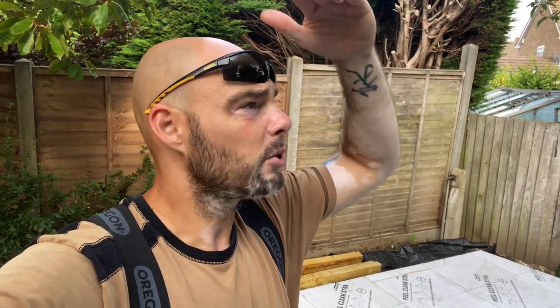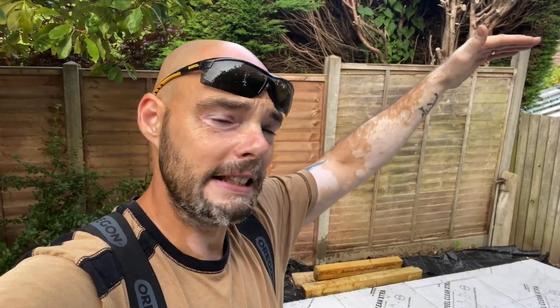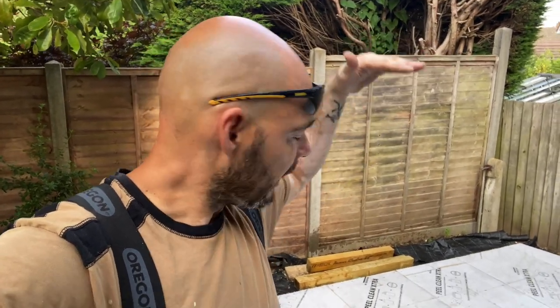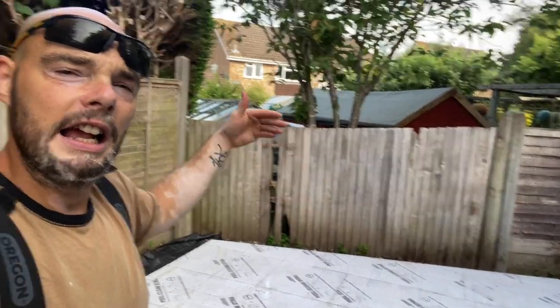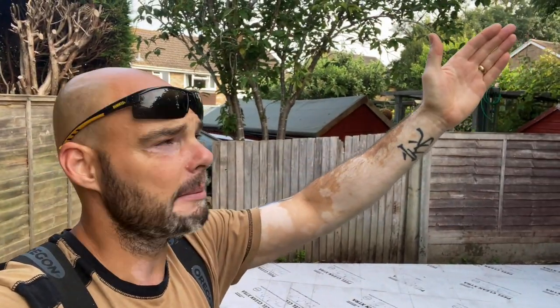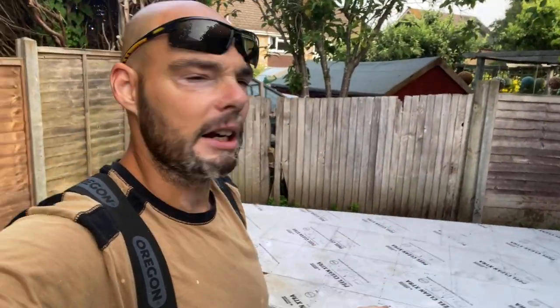We've got a pitch, which means we need an extra 25 mil to take into account. For the run on the roof, you want to make sure you've got 25 mil drop per meter. So you're working out all these bits and pieces, your overall heights, all the materials, and then just subtracting where you need to. That left me with a 2 meter wall at the front and 1.9 at the back and sides. Then the roof joist will go on the top, obviously. I've got 120 mil by 80 by 5 mil steel running across. So sat down a weekend, quickly done my calculations, and that's where we're at.